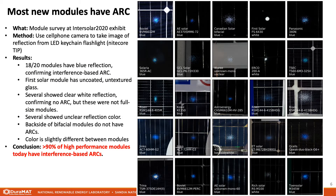To demonstrate the ease and utility of this method, I surveyed modules in the Intersolar 2020 exhibition. I walked around the exhibit floor using a keychain flashlight and a cell phone camera. About 18 out of 20 modules surveyed showed a clear blue reflection, which confirms the presence of anti-reflection coating. The only full-sized module showing a white reflection was the First Solar module. I also noticed that the backside of bifacial modules do not have anti-reflection coatings. In conclusion, we'd approximate that over 90% of high-performance modules produced today have anti-reflection coatings.